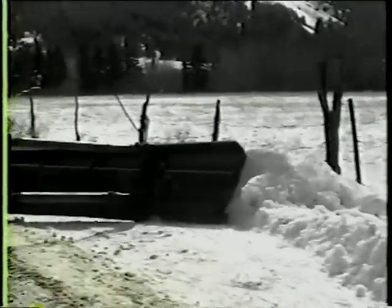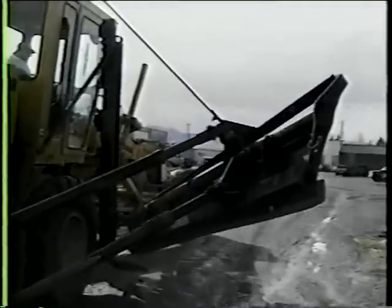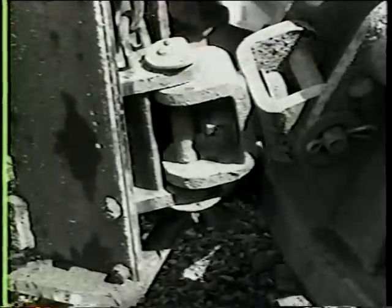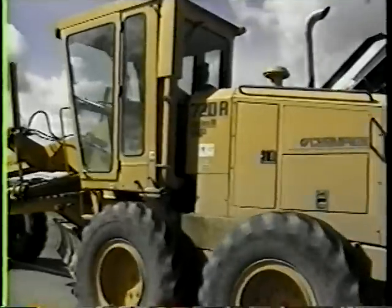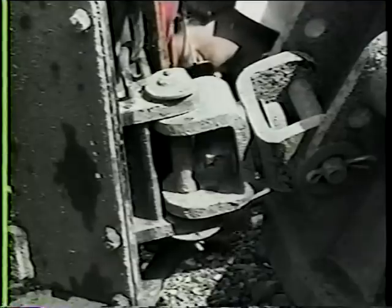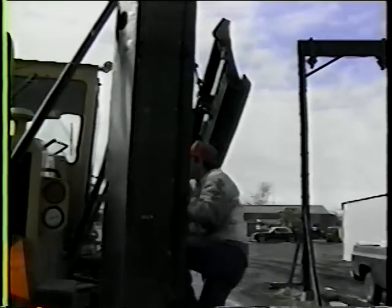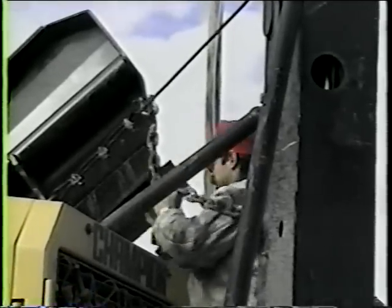The wing plow is perhaps the most complicated of all plow types. It requires the connection of front and rear most interfaces to the telescoping hydraulic arms attached to the plow. This film will illustrate the use of a common wing plow interface used today. It is assumed that the proper interface is already in place on your motor grader and your task is limited to attaching the mold board. If your motor grader wing plow interface connection is different from the one shown, consult your dealer or manufacturer for specific instructions. The front mast is used to connect the inside or toe of the wing to the motor grader, connected to a hydraulic piston that raises and lowers the wing inside or adjusts the toe height. Most models also have a hydraulic arm to change the pitch of the wing. A safety chain or cable runs from the top of the mast to the outboard or heel end of the wing.